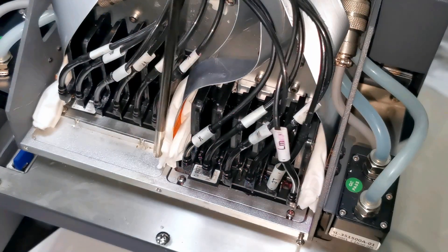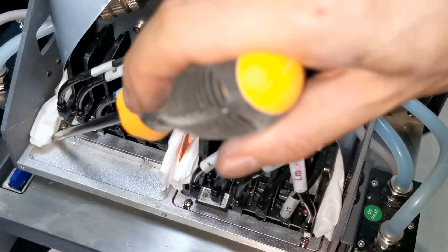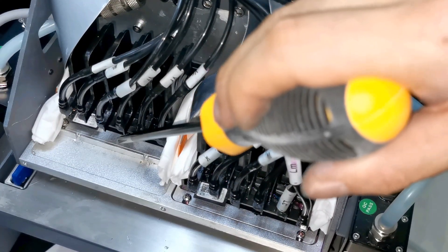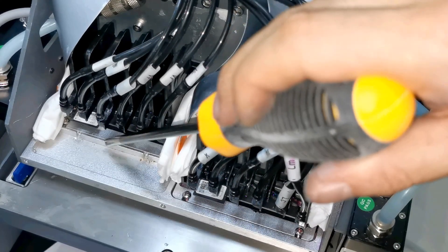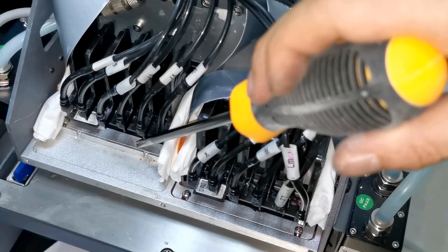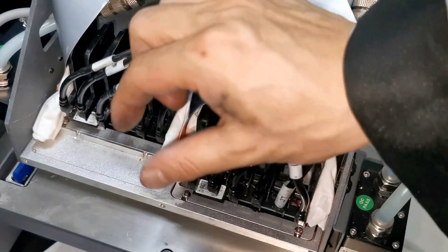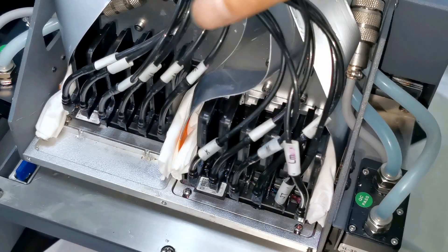If it's not okay, we also adjust the screws here, and here, and here to make the palette of the print head adjust to left or to right. But not front and back. Please remember, it's not adjust to left or to right directly, but a little bit of angle — a little bit angle to left or to right to be sure the lines are straight.